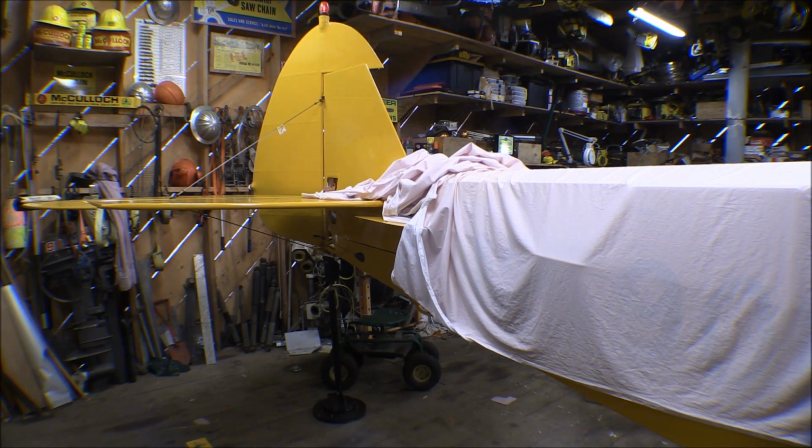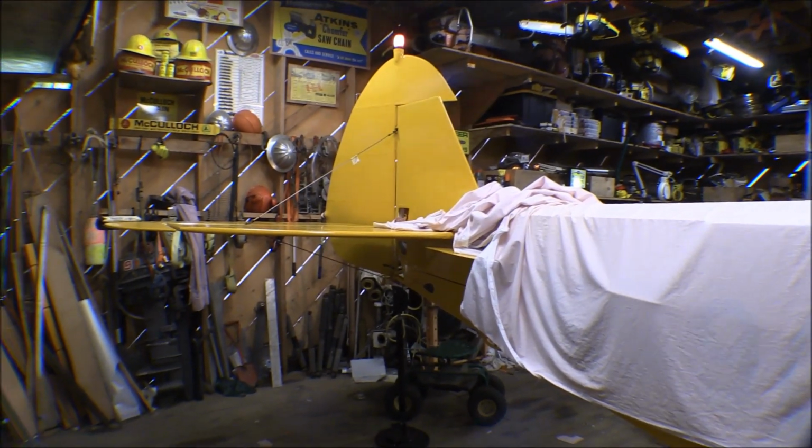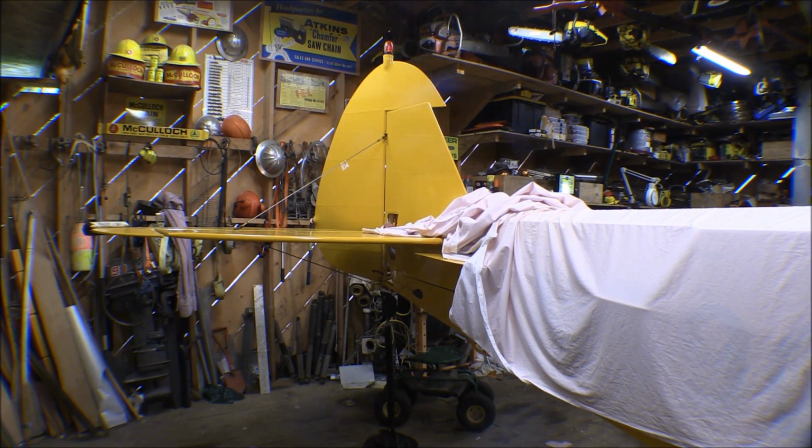I got that cover for the lower rear handhold on the tail there, on the elevator, that goes on the left side where the nav light, beacon light supply line goes through. I got that drilled out for a 1-inch grommet and fitted it up. Now I've just temporarily tied those wires together there on those feed lines to make sure everything works, and the beacon works and the rear nav light works, so that's a good sign. Oh, now I can put the plug on those.